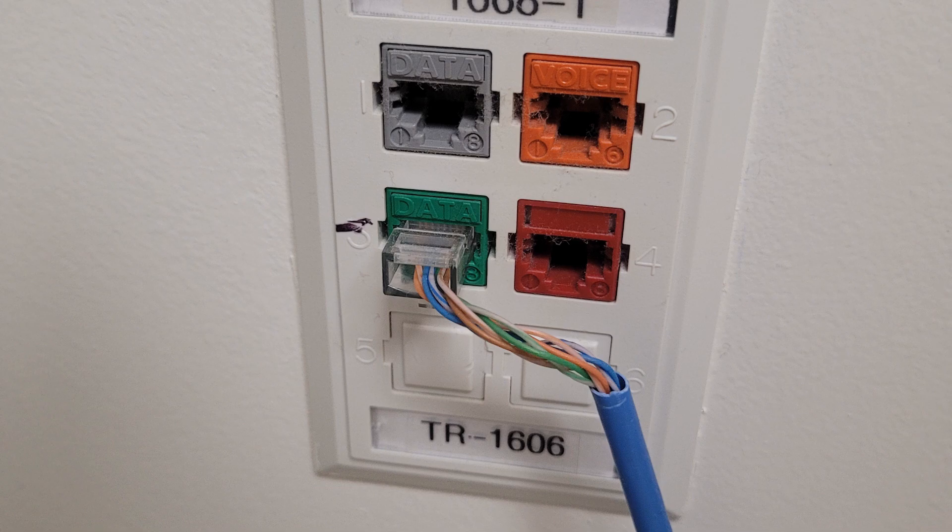You take these boxes that are about two inches thick and they can be recessed right into the wall, with covers over them. You put your switch, your router, and your patch panel in there. Don't do this cheesy stuff where people put mod plugs at the end of the cable — that's great for day one, but when you wiggle it and unplug it and move it around, those mod plugs get loose and you start to have intermittent problems. The hardest problem to solve is an intermittent problem. Just do it right, do it professionally — run them into a small patch panel. A 12-port patch panel should handle any house.